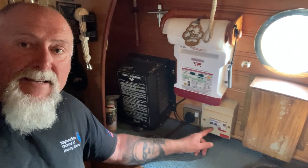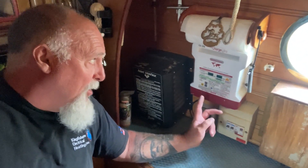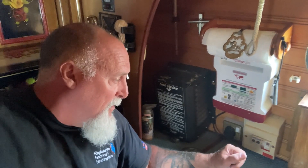Here we are in the back of the boat. There is a 12-volt distribution board, a battery charger, and a fairly low-powered inverter. This is the 240V setup we need to get into and find the earth cable coming in from shore power. All this equipment is actually coming out and we're going to go to a bigger inverter-charger — a Multi Plus — which will handle both the charging and inversion side for 240 volts. Right now this boat has never had a galvanic isolator fitted.